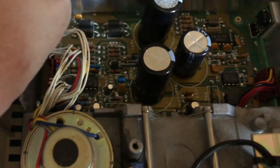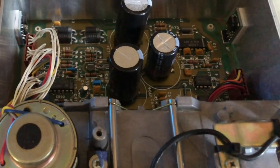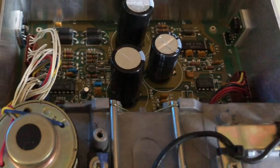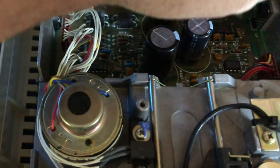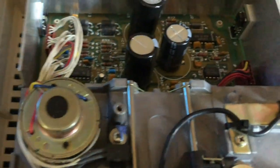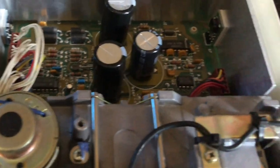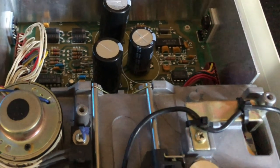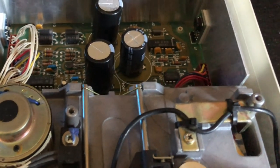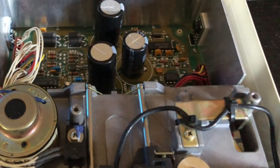But no, I mean, the drive's sitting idle. Before we did the conversion here, I believe the 7805 was on this side, but don't quote me on that. Just sitting idle, it got really warm, because that's a linear regulator versus a switching one. So this drive has operated absolutely fine. I ran the same exercise loop on it last night for much longer, but I didn't have the screws out of the case, so I couldn't really test temperature, which is why we ran it this morning to record this.